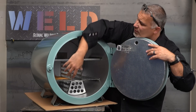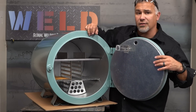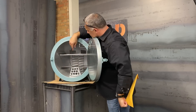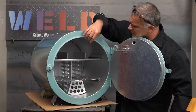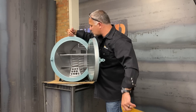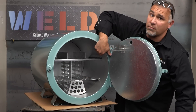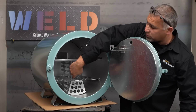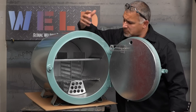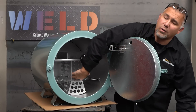Inside we've got large capacity. A 50-pound box of electrodes will slide right inside of there. The heating element is down here, protected from the outside, and you have different sized openings. The ones I normally run at school will run like 3/32 electrodes on one side, 1/8 inch on the other, some 5/32s on top, maybe a couple of 3/16ths and quarter inch. We use the inside middle just for stubs — where you've not burnt the entire rod yet — maybe not something I'm going to light up for a test, but if we're just practicing running some beads we can keep those right here in the middle.